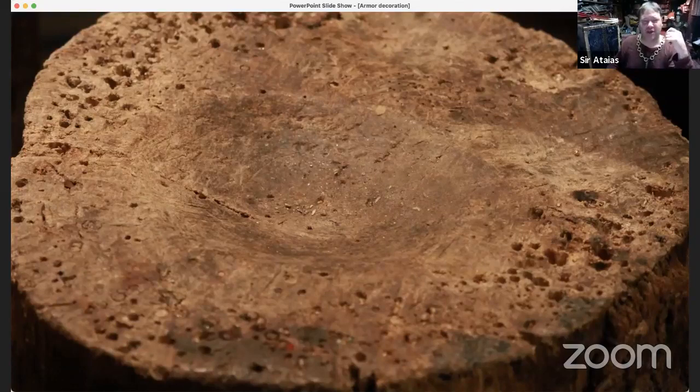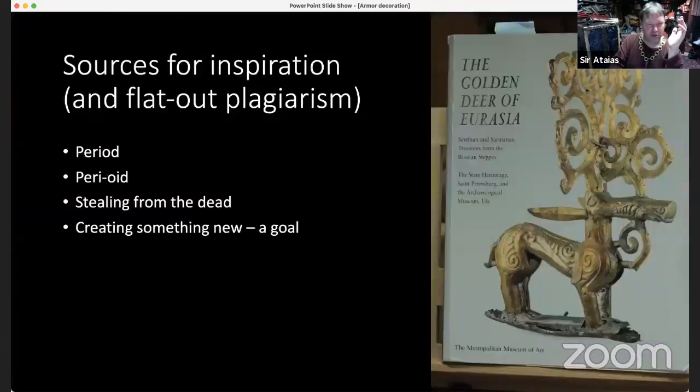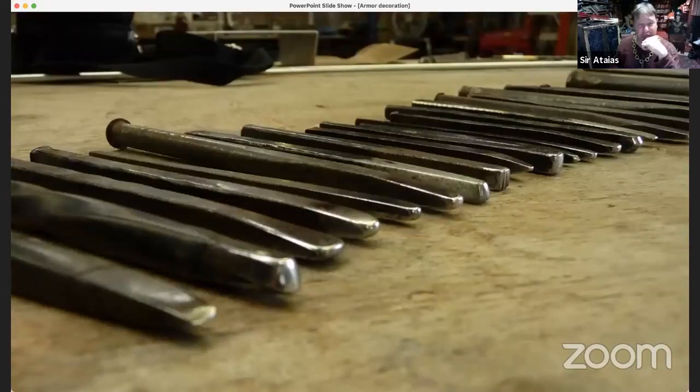And that also applies to hammer surfaces and chasing and repoussé tool surfaces. Those are so shiny and smooth because they need to be that way, otherwise you are transferring whatever defect is on that surface to the metal. If you don't want those defects, that's why all these tools have a mirror finish. Not just because of the shape, but because you want a nice clean surface to work with. And that's why I also need to redress that steel plate that I've got, so I'm not transferring whatever is on that surface to the metal I'm working on.